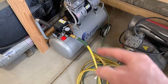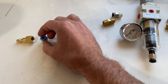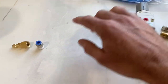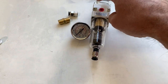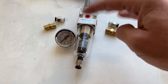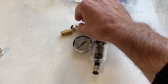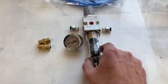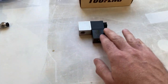So it'll basically fit right in where that hose is going. Then it comes down to one of these quick-connect nozzles for this blue hose. That blue hose will go from the compressor over to this regulator that also serves to filter out the air and get water out of it. We'll put this together and it will have these on either side.